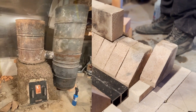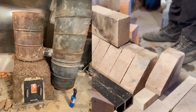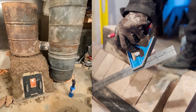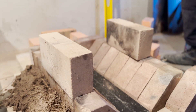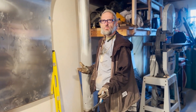It looks like a lot of work to cut all of the bricks at that angle — why have we done that? As your pile of wood in there becomes less and less, the coals tend to tumble down and focus in the middle where they keep each other warm and they keep burning. Whereas if you had a flat floor, they would just kind of settle into a bed of coals that don't really keep each other hot enough.